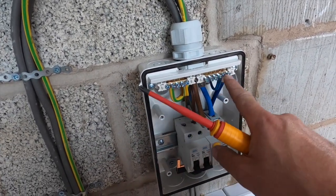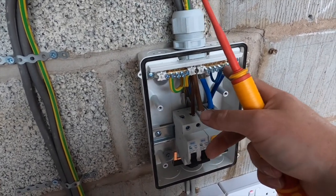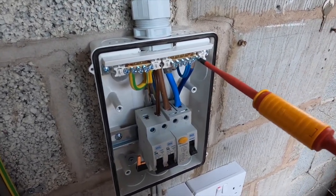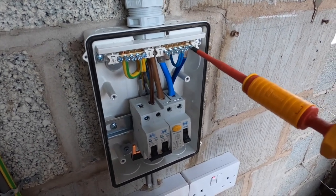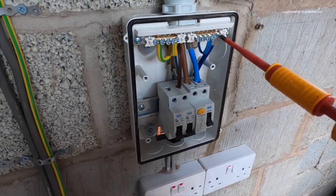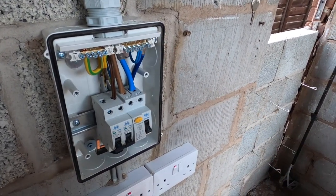So I thought I'll give a little check, and these are all torqued up now, like it says in the instructions, at 2 newton meters. I tried this one here, and it's surprising how much further in it actually goes to the right torque setting. It just goes to show that from when it leaves the factory to whenever you buy it, they're not necessarily right. It shows you the importance of checking that they are at the correct tightness. So overall, very impressed.